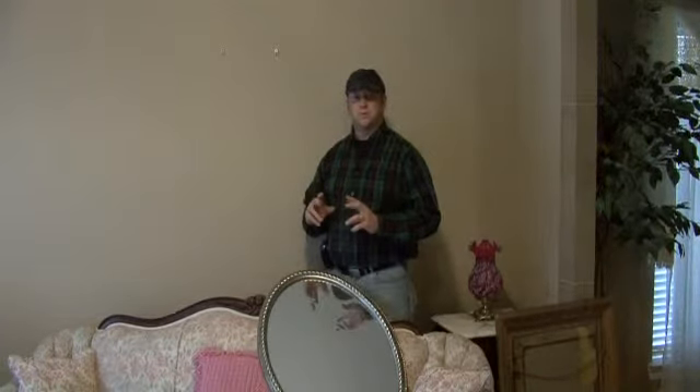Hi, I'm Tim Gibson and I'm going to talk to you about how to hang a heavy wall mirror. The first thing we've got to consider is the attach points in the wall. We want to use a device that is rated higher for the amount of weight it will hold. These are usually rated in pounds, and something rated around seventy-five to a hundred pounds would be really good to use.